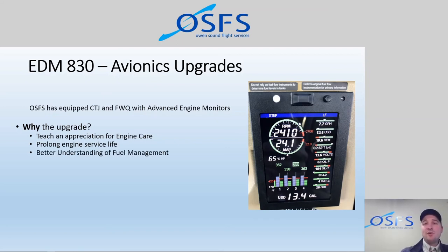Fuel management is a huge one. So the EDM 830 has some amazing fuel management tools that tell us everything from how much fuel we're burning to how much is left on board, as well as the effects of leaning the mixture and what that is actually producing as a result on fuel efficiency and also engine efficiency. And as you've learned maybe in ground school, too rich a mixture isn't good either, neither is too lean a mixture. And there's a balance in between, and a lot of pilots sort of shy away from mixture control post-license because when you pull that red knob back too far, the engine makes sounds that people don't want to hear. But leaving it all the way rich is also really bad for the engine. You just don't hear it, but you see it later, fouled spark plugs and things like that.